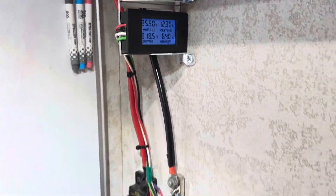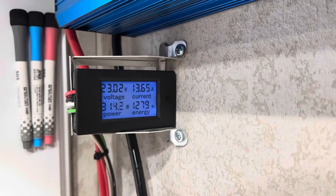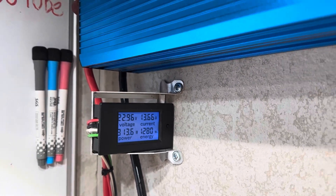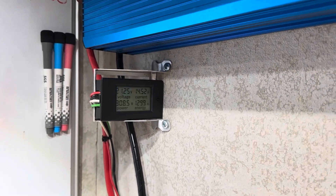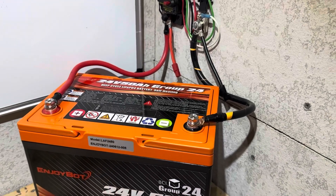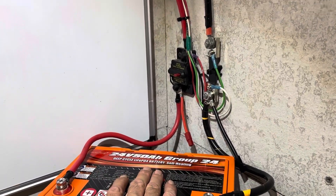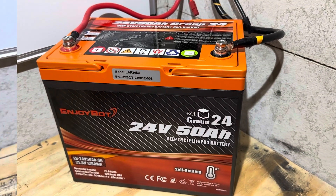At the halfway mark based on nominal capacity, we keep pulling. We rolled over the 1,280 watt hour mark — that's our money's worth — and kept going. The energy meter alarm triggered and the inverter hit low voltage disconnect. Final result: 1,299 watt hours, which pulled the BMS out on the battery all the way to low voltage disconnect. It took roughly two minutes to recover and the BMS came back on. That's approximately 50.75 amp hours — almost 51 — so it met its advertised expectations.